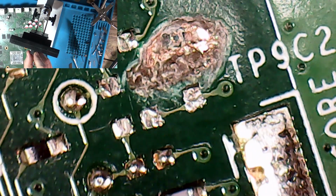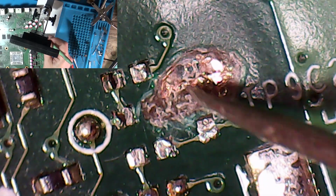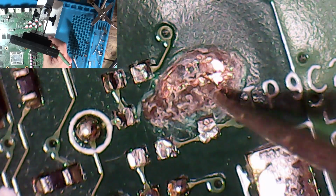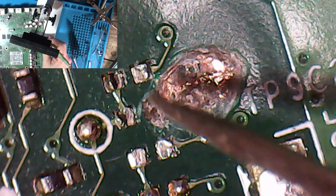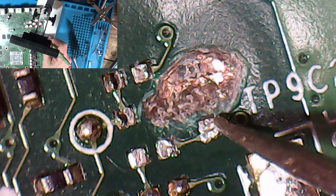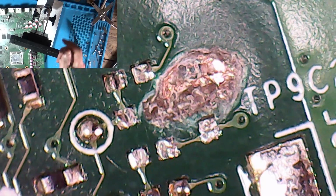And this has just got a bit more interesting. Where's my hole? There. Right, so we could fill this in with conformal coating, because that is a ground via, so it doesn't matter. And we could connect all these resistors up together, put the resistors in there, with a wire to that via in there. That's fine. Can't see it again now.